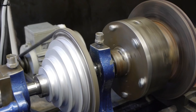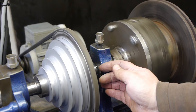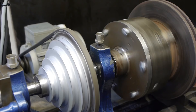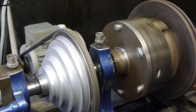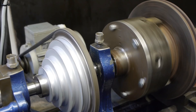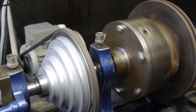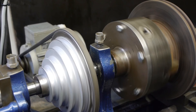With the torque compensation parameter set back to zero I can still feel a little vibration coming through the headstock, and that's only at 70 rpm — about 8 hertz. You can also see the belt jumping up and down, so I really think this vibration must be coming from the motor. I have no other ideas, but if you have any thoughts on this problem please put it in the comments. The rattling noise is probably one of those pinion gears being a bit loose. Anyway, I will be on the lookout for a better motor — preferably a six-pole one, no more than 1.5 kilowatt because that's the maximum this belt can handle.